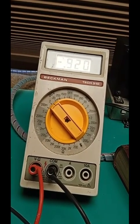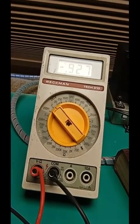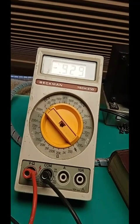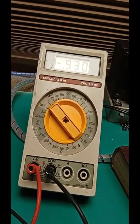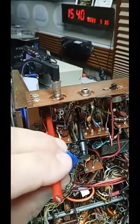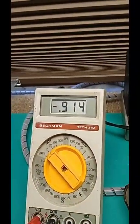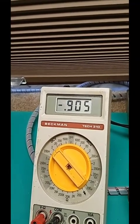Three or four. That's indicating to the millivolt. And then I let it rest. It's a mechanical VFO, it takes time to settle out. That reading needs to become stable. And now I put the diddle stick on the bottom slug, and I very slowly turn it either way to find a peak